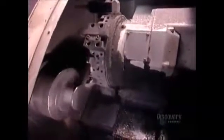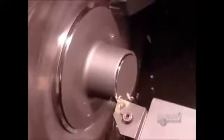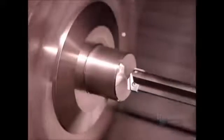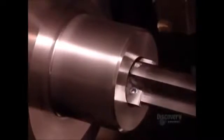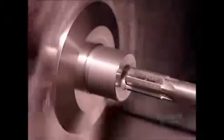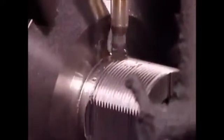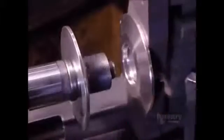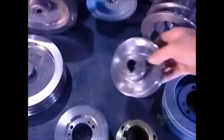This is a two-part pulley, known as a variable pulley, because it can run a belt at variable speeds. A tooling machine performs several operations on the male component — machining the face and outside diameter on one side, then flipping the pulley over to make the bore and threads on the other side. The last operation drills holes for two screws that affix the pulley to the shaft of the electric motor. A touch of lubricant and the next machine assembles the male and female parts; after setting the proper speed, the user locks the parts in position with a screw.